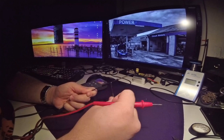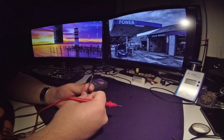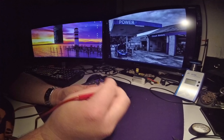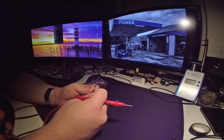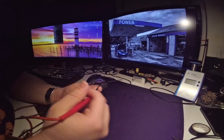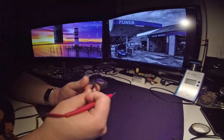It's the same process for the Immortal T receiver antenna. Get it off your receiver and check if the small connector's middle pin has continuity to one side, and the shield has continuity to the other side. You don't want no continuity at all, and you don't want continuity between the shield and the middle pin.